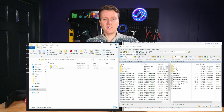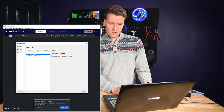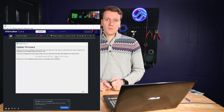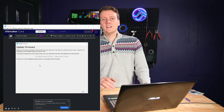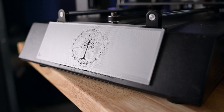This is the hex file we now need to flash onto the 3D printer. I use Cura to flash it, but there are several other ways you can flash firmware. In Cura, go up to your Printers, click Manage Printers, go to the one you want to update, and connect your computer to the printer using a USB cable. Click Update Firmware. If these options are grayed out, make sure your printer is turned on and make sure the cable really works. Then click Upload Custom Firmware and select that .hex file to get it uploaded to your printer. Before I uploaded the custom firmware, I did unplug the front screen — I've heard that can mess with installation, and since the touch screen won't really work with Klipper, I just went ahead and unplugged it. I also printed out a front cover to completely cover up the screen since it's not going to be on anyway.